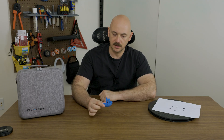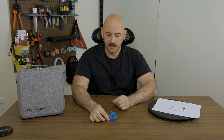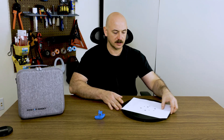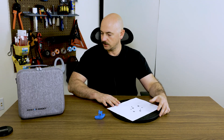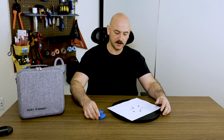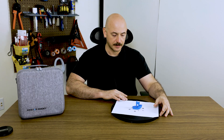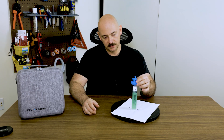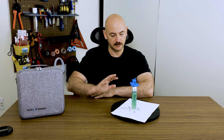What I've done is taken this 3D Benchy and constructed an apparatus in order to scan it. The reason why I had to do that is because this Benchy is rather small — actually smaller than the type of items you would typically scan with this type of scanner. So I've put some markers on a Lazy Susan spinner to give me some orientation, and then added more markers elsewhere to be able to scan the bottom and have markers in view of the scanner from multiple angles.